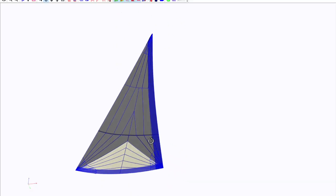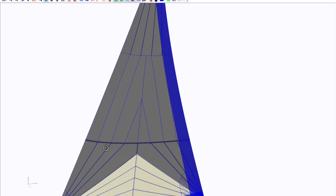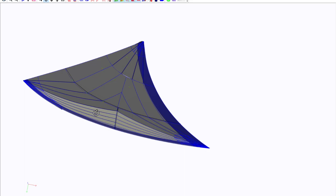Which in the old days with pencil and paper, you couldn't do that — you were working with flat triangles. But now we're working with foil shapes, so I can get right in there. With modern design you can actually describe the rig really well — the rod size, the wire size, the size of the shrouds, the spreaders — and get really accurate. So if you're doing a really big one-off racing project and you wanted to get it bang on, you would definitely do that.